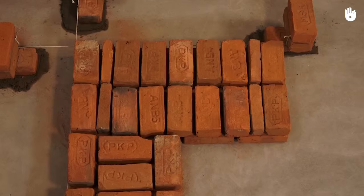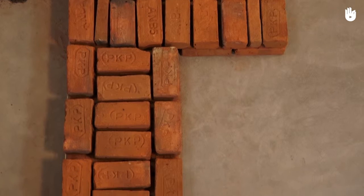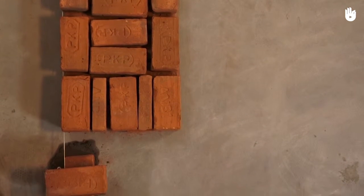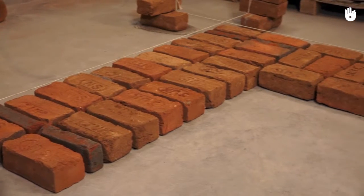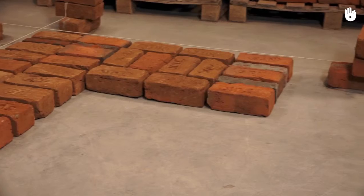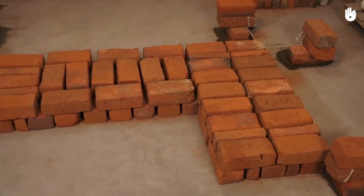The arrangement of bricks in an English bond of 2 bricks thickness uses pairs of headers to fill the interior of every stretcher course, except where the course ends. The interior in the terminal section of a stretcher course is filled using 2 queen closers placed on either side of a centered stretcher. Bear in mind the count and arrangement of bricks before removing the dry bond.